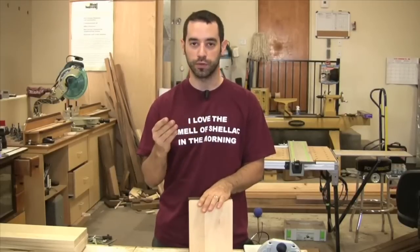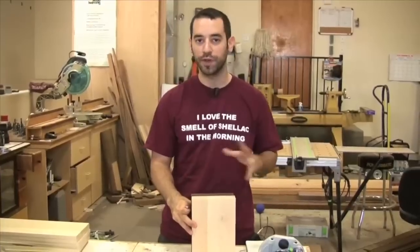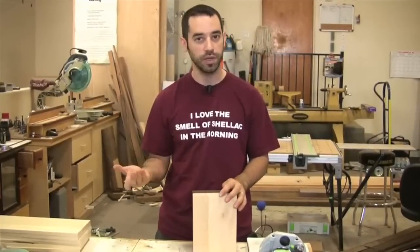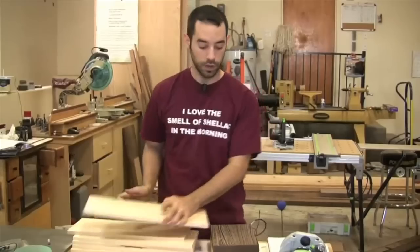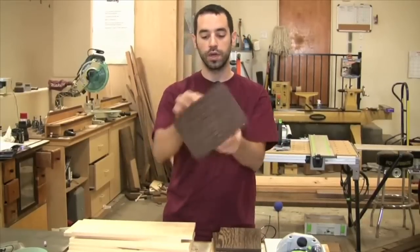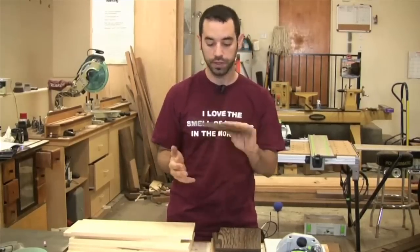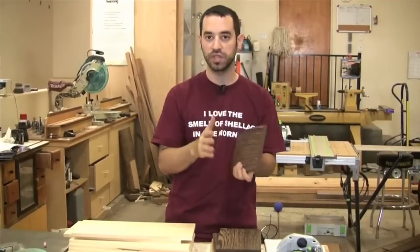Now, one more thing before we actually make any cuts. A lot of times, different manufacturers require you to do different little things to make sure that the boards for your drawers are facing in a particular direction so that they're milled properly. In this particular case, I don't even remember exactly what faces out, what faces in for the individual cuts, but I'm gonna prepare for that by marking the inside and the outside of each piece so that we can have them straightened out later. Now, if you've got particular pieces that look exceptional, for instance, you want a particular orientation of your drawers one way or the other, the good thing is, the way this is gonna work, it's not gonna matter. You could flip that back and forth, but you will probably have a side that looks better than the other. In this case, these are almost identical, but in a lot of cases, one looks better than the other, so you wanna mark the inside and the outside, so it's very clear which side is which.